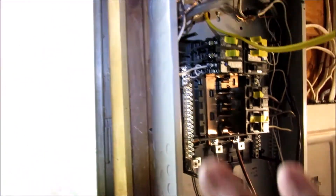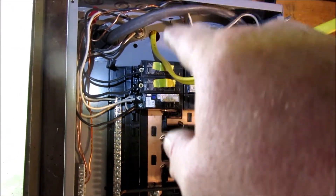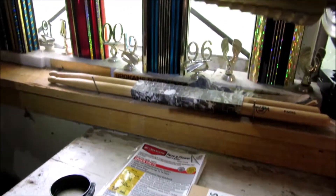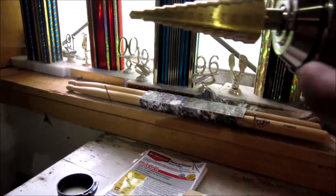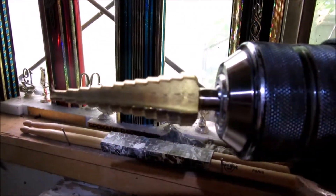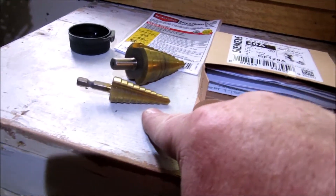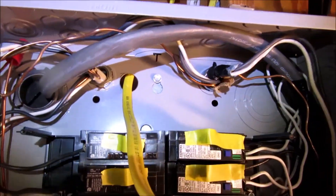I needed to do this kind of after the fact, so I was showing you something you can do if you're forced to mount something on the outside wall like I am. You're kind of out of the correct holes where you want them as far as where the wires come through. You can use — at least in my area — these step bits here. I'm not a huge fan of step bits but for this it worked pretty good. I figured out it's up to the 13/16th mark — the one before the very end — because the smaller one was too small. I went with that size because it seemed to work, and then I had to go in there with a file a little bit more.